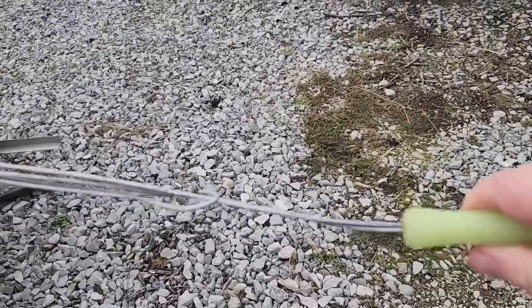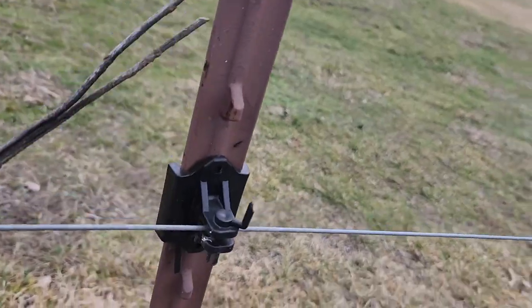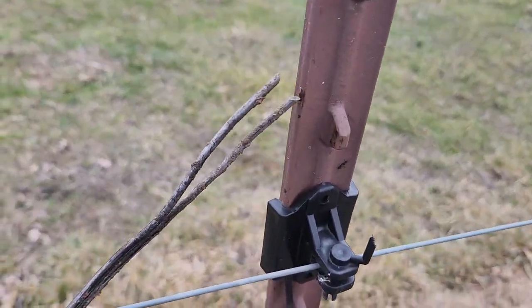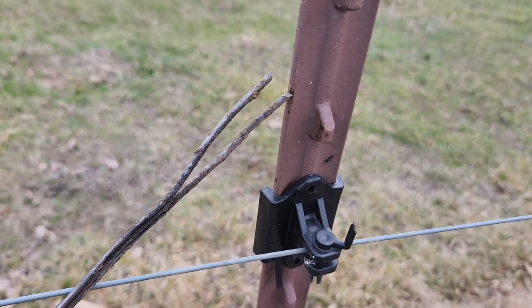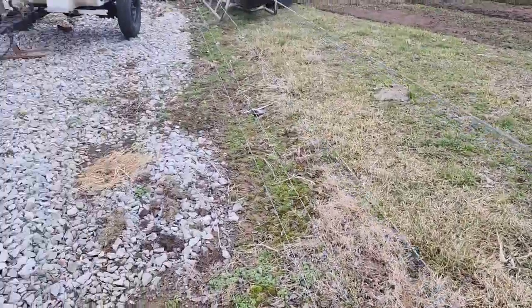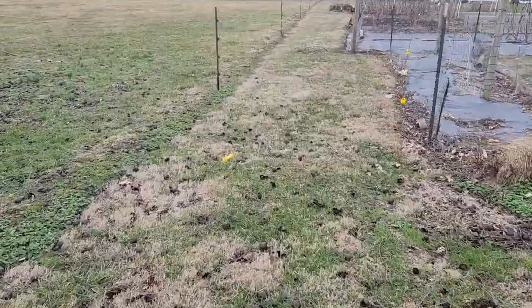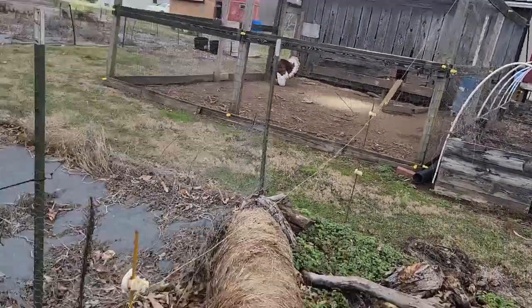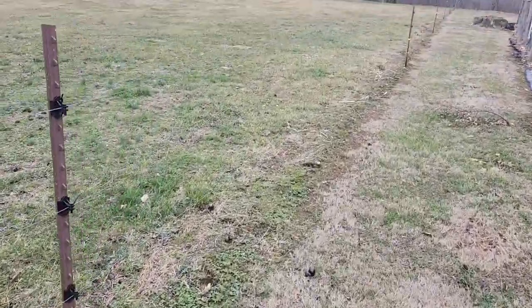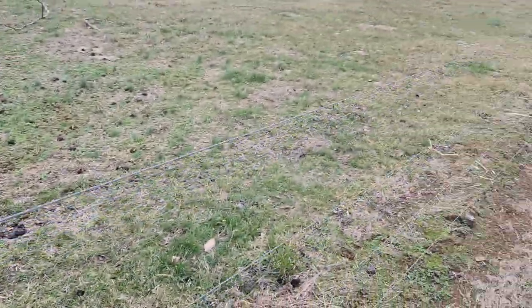And oh yeah, I got my high dollar electric fence tester, also known as hot dog roaster. Still not a very good spark there. So we're going to keep moving down the line here. That's what goes to the chickens, or it's the turkey's coop now, which I disconnected to eliminate any of that. That Premier One netting probably draws a lot. A little bit there, but still not great.